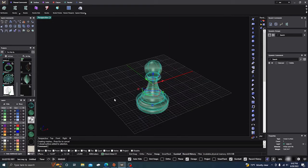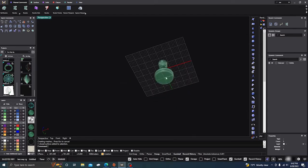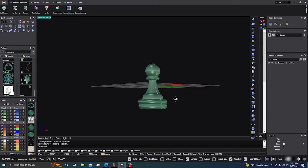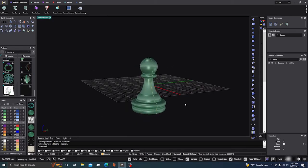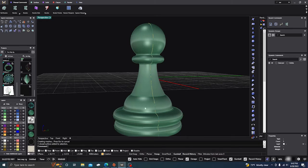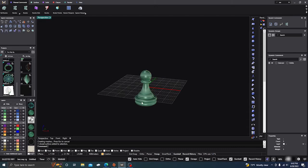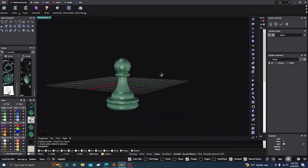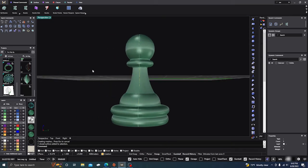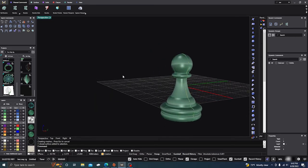From here, check that it's a closed surface — everything's good to go. All you have to do is transfer this to an STL file, add sprue on it, and it's ready for casting as a 14-karat gold pawn — or you can do whatever you'd like. You can add design, add diamonds, add bullion, anything you want. That showcases the Revolve tool and the picture frame — both very useful for design work. If this video helped or gave you new ideas, please leave a like, subscribe, and a comment below. Thank you for watching — good designing!